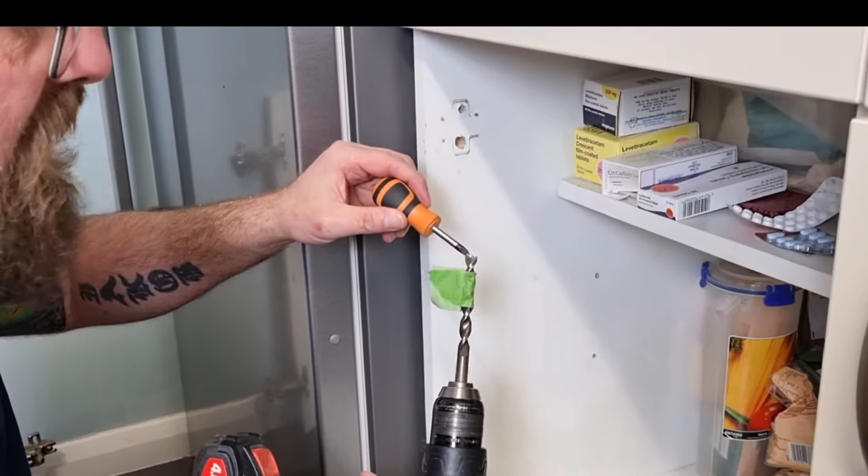You'll have noticed I was going really steady when drilling these holes, and that's because we're using a brad point drill bit which is designed to cut through wood. These are quite aggressive drill bits, and if I go too hard the drill bit will just grab hold of the wood and pull it straight through. So I'm actually starting off in reverse, going really slowly, then building up very slightly — almost not even pushing on the drill, almost pulling back slightly — and that's just going to make sure I don't go all the way through into my fridge.